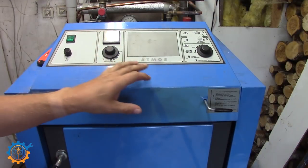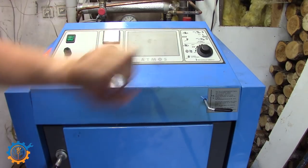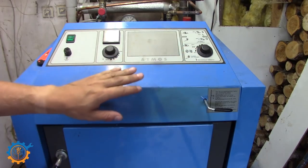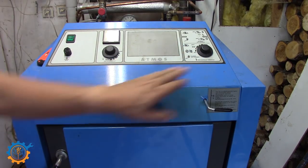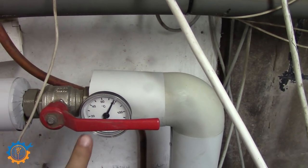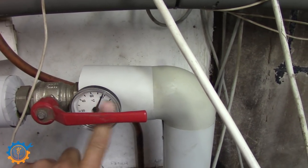And when the temperature is up, as you can see, I take this knob and turn it up towards the working temperature. That ensures that this one actually shuts down when the temperature goes down and they have stopped burning in the wood boiler. As you can see in the top here, it has started to charge the tanks. It's 80 degrees up here and it goes and flows into the tank. So that one is actually doing its job perfectly fine.